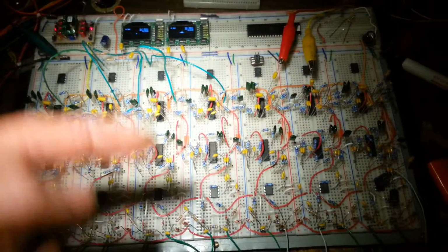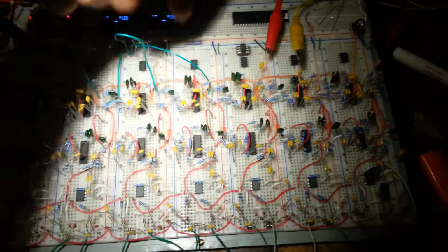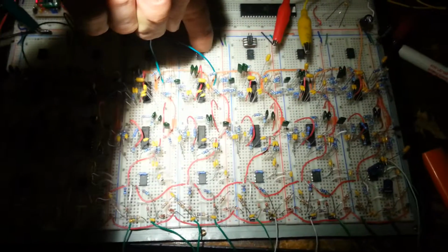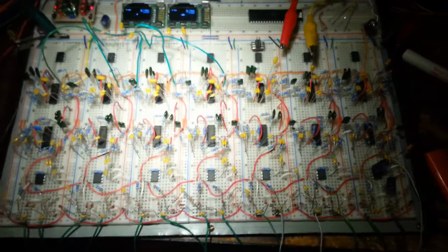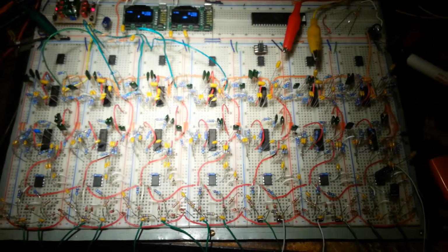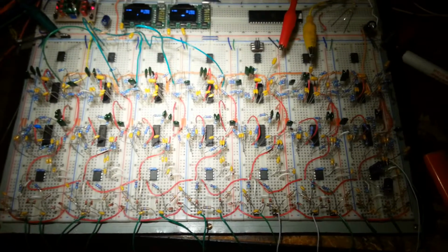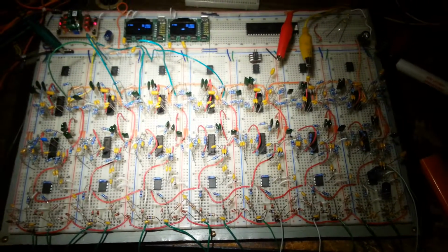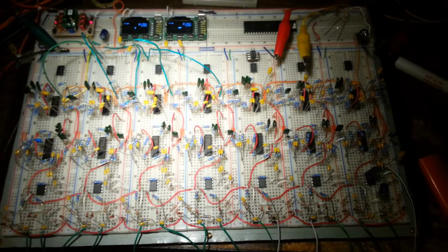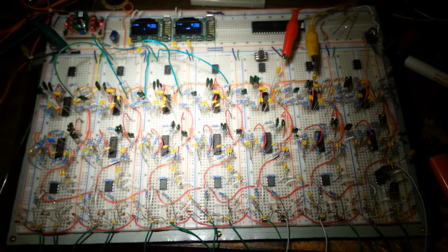But I'm going to make it so that the gain of each channel can be controlled individually. So there's a microcontroller for each channel that does the sampling and the gain control, along with a little bit of local buffering and this and that. Maybe some average filtering. But anyway, multi-channel EMG. Lots of parts, not all that complicated. Just a bunch of Butterworth filters in the right order.